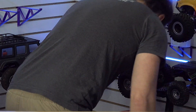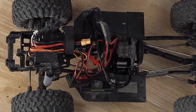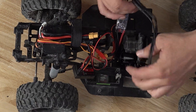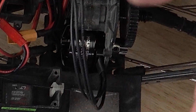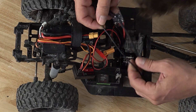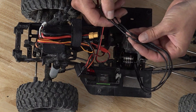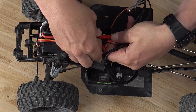One more example down here — what not to do. We've got this rig — I think it's an SCX3 maybe. We've got our stock wires coming off of our motor. This is a 540M 1800 KV — the new one that we just came out with. It does come with the thinner wires because it's only 1800 KV, so this is 18 gauge wires. No issue with heat in a crawler. If you gear it up to go really fast, you may have some heat issues. We've got our wires, also 18 gauge, going into a very small speed controller. And then we have our direct power wire going here as well.